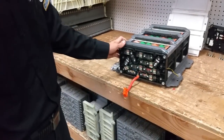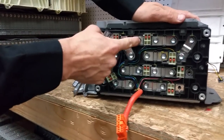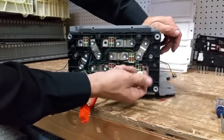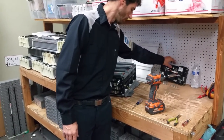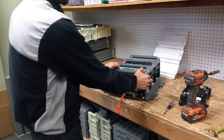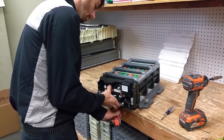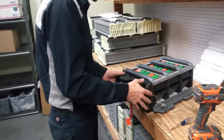Another mistake I've made many times: don't put 10 millimeter bolts in these spots — one, two, three, four. Remember, that's where the washers go. We're going to have bolts later that go through and hold it together. If you put them in there, later on you're going to be trying to find these spots and not be able to. So don't make that mistake. Next thing: pop the other piece back on here. There's a little channel right here where this wire is going to go, so put him in here and it hangs just like that. There are two little hangers right there — let those guys go in.